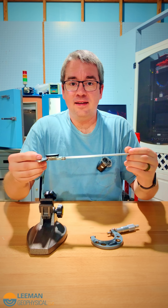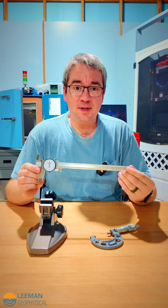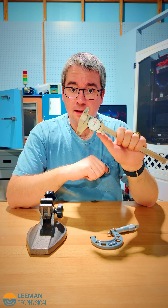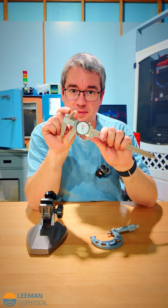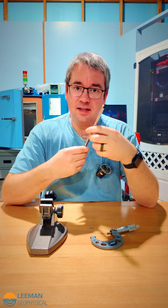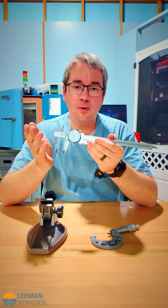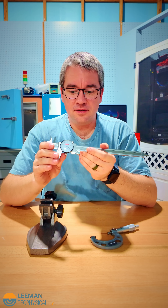You may not need a set of micrometers. In fact, the caliper is kind of the Swiss army knife in the lab or in the machine shop, which means it does a lot of functions pretty well but none of them great. With a caliper, you can measure the outer diameter of something or the inner diameter of something. You can also measure the depth of a step using the back of the head here or the tail sticking out here. This is a really versatile tool, but I wouldn't trust it to more than a thousandth or two, and sometimes not even that. Technique has a lot to do with it.